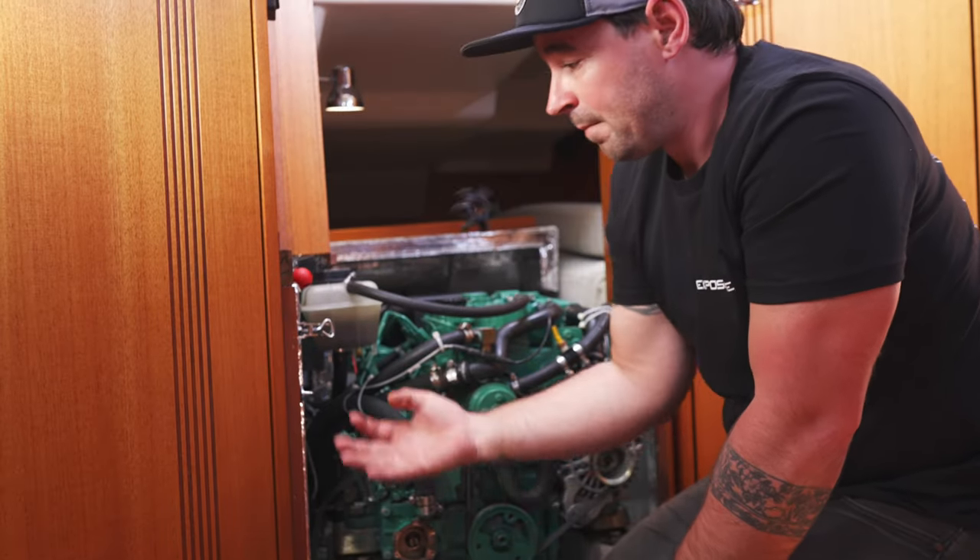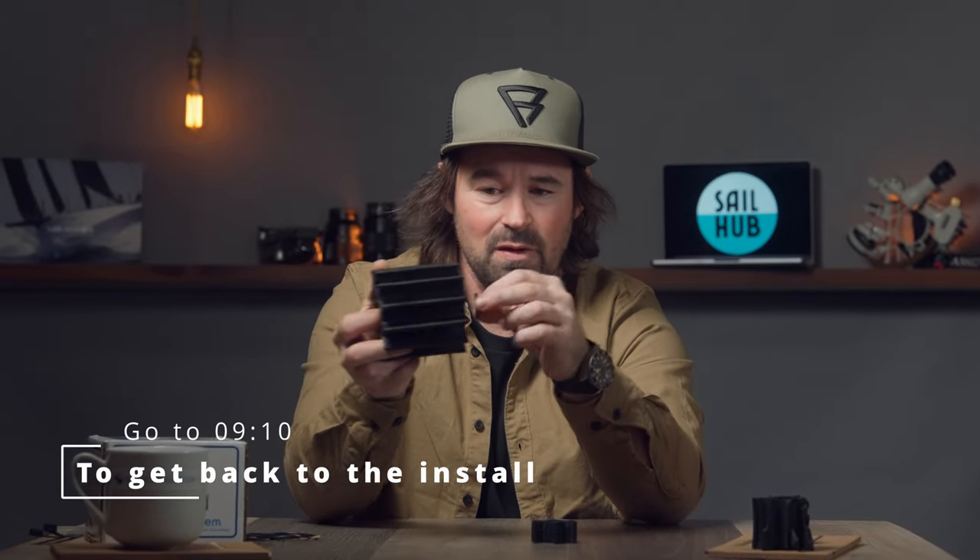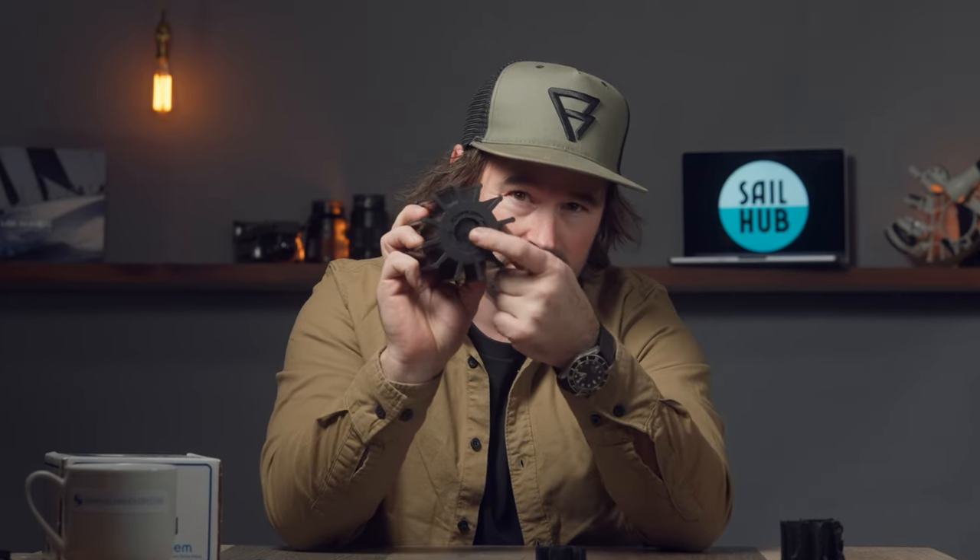Now we've got to think about the new impeller. We've also got one of these to worry about — once you've attached and fitted this into the pump, this goes on the end. It helps prevent end float on the system and helps prevent water running off elsewhere. So really important if your system does need one of these, that you fit that. Sometimes they don't come with that. This one came with these seals, and that's the ones you should fit. Try not to use any sealant or gasket on this, because if that gets squished into the chamber you could have problems. Don't reuse your O-rings — and if you do have to reuse them, give them a stretch and look all over for cracks and any signs of deterioration. You don't want to lose pressure to your water system through those seals.